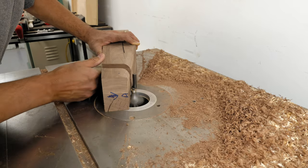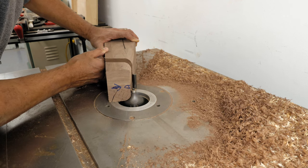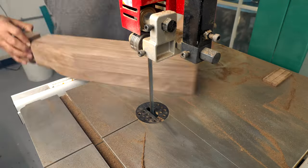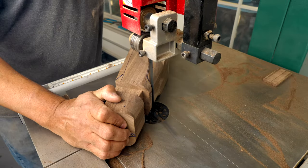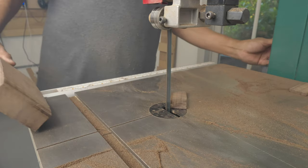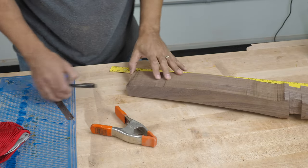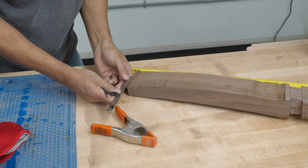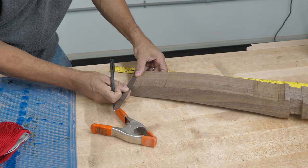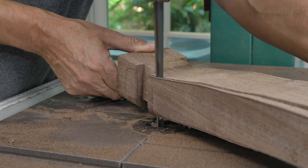After test fitting, I move over to the shaper table to round over the inside corners of the joints using a three-quarter inch round-over bit. From the foot of each leg, I measure five-eighths either side of the center line, drawing a line up the leg to the shoulder joint, and then trim away the excess. As I exit the cut, I tip up the leg so I can keep the cut parallel to the joint.